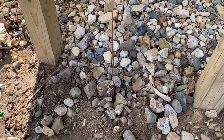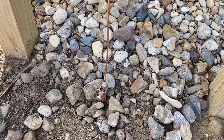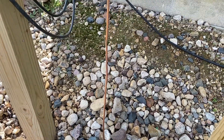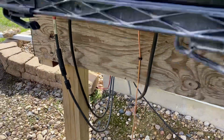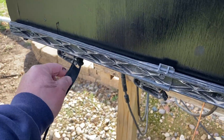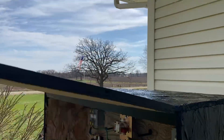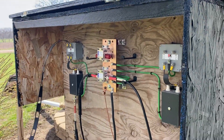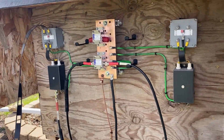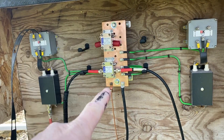To improve that, we came out and went down with a good old copper ground rod like you should be using, and I got a number six solid copper cable coming up. Let's look inside the box here.